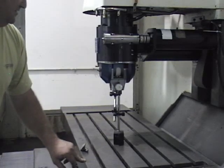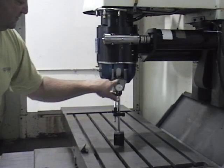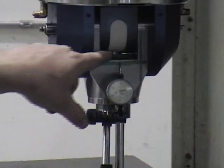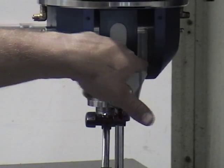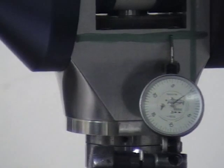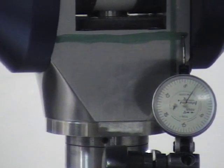To indicate in the A axis, start at the center of the spindle block, which is our rotational pivot point, with zero. Jog the table over until the indicator reaches the back edge. Whatever reading you get, jog until the indicator is back to zero.